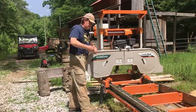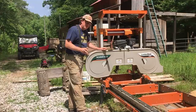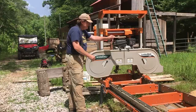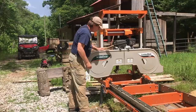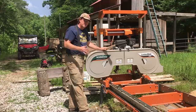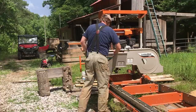The combination of running on the steel guide wheels and of course the wire brush allowed most of that rust to be taken off. There's still a little bit, but that takes the majority of it off and takes off any high points, any sap buildup. Now I know you may think, Troy, that's not the smartest thing to stick your hand near that blade — keep in mind I'm on the backside of the blade behind the frame, reaching through with a wooden wire brush. The cutting surface is on the front, and my hand is a good 10 to 12 inches further back. If the blade would even jump, it's not coming back — it's going forward — so it's fairly safe. Obviously the issue is if I go forward, if I trip and fall, that's a big issue, but the sawmill is inherently dangerous to begin with.